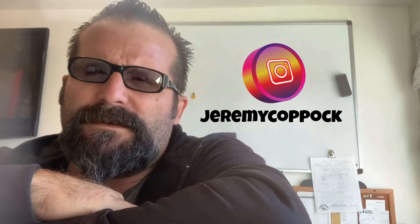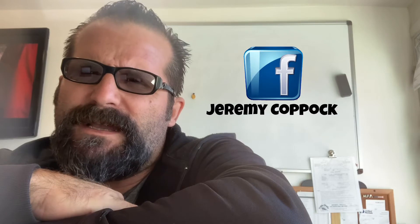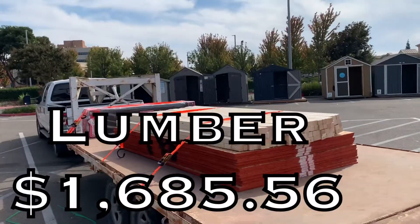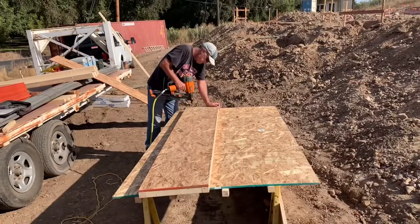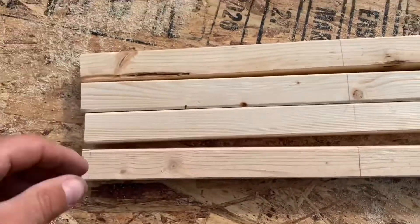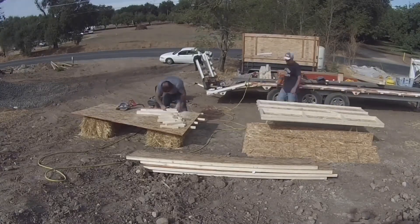I had to make forms to form up the foundation. I bought some lumber — 3/8 inch OSB and one-by-one lumber. I picked up the plywood, brought it out, and set up an assembly line. We got busy cutting all the pieces. Out of one sheet of plywood I was able to make three lengths of 16-inch form by ripping them into thirds, then set up a template and cut all the form pieces at once.